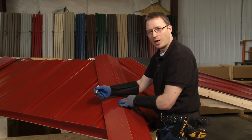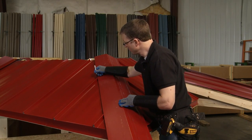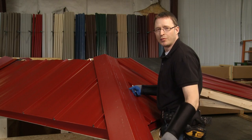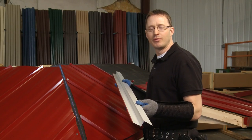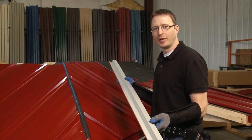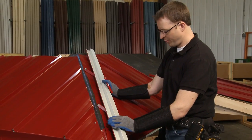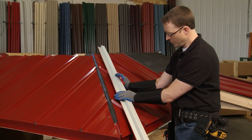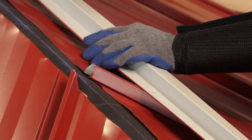With the hip cap in place, I can mark the tops of the ribs with a sharpie or a pencil, and that's going to tell me where I need to position my Z-Trims. I'll then remove the hip cap, get our Z-Trim, cut them to length, and install them. In the same way that we use Z-Trim for the installation of end wall flashing and side wall transition, we're going to do the exact same thing here on the hip. I'm going to put it in place by lining it up about a half inch behind the marks that I made with the sharpie, and just make cut lines to show me where I need to cut it.